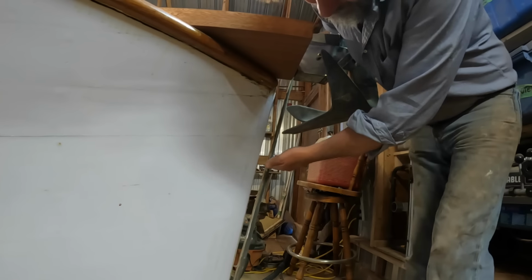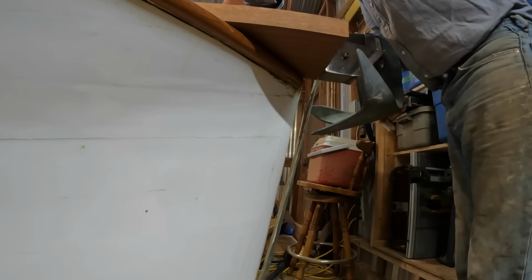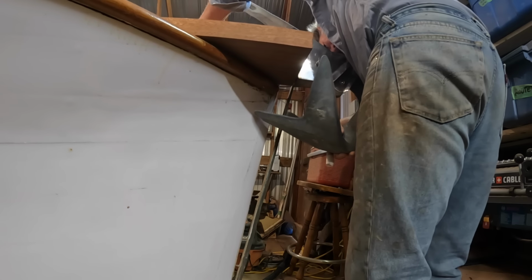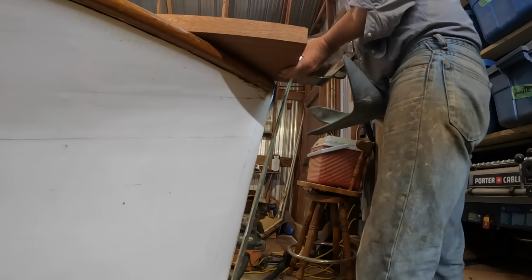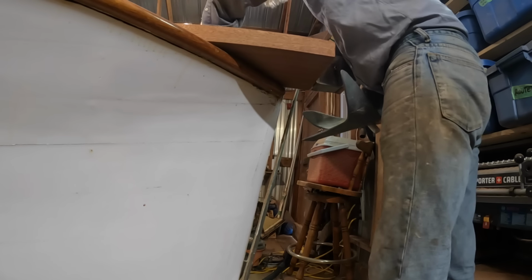Okay, so at this point, never mind that the stem brace is actually loose here, you can see that there's plenty of clearance, but the clearance I really care about is during deployment. Watch how it rocks back when it starts to deploy. See that right there? Bit too close. Yep. So we gotta come back out a bit. Let's say there. Let's try that again.